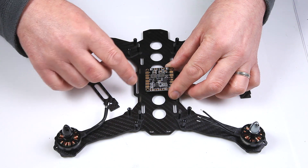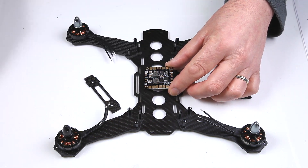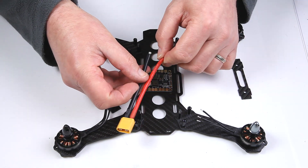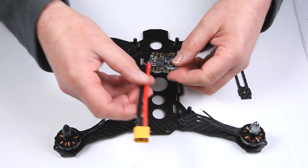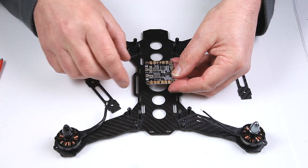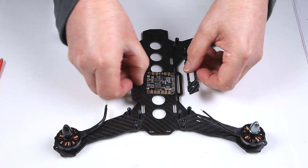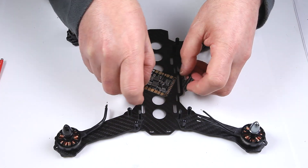You have to make sure you put it around the right way, because we're going to have the battery lead come out that side. That's another thing I've replaced — this is a more heavy duty one and it's an XT60 as well. I'm just going to solder that on there. We need to pre-tin all these, but now I know it's going to fit in there no trouble at all, we can move on to the soldering and starting to get everything going together.